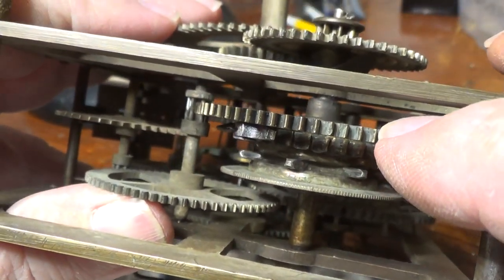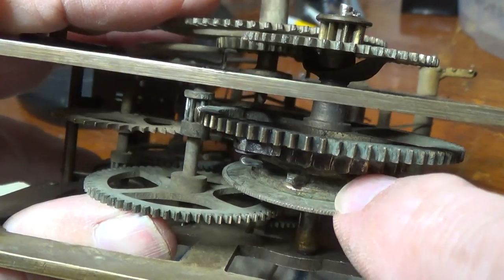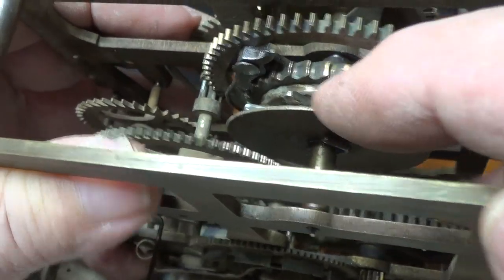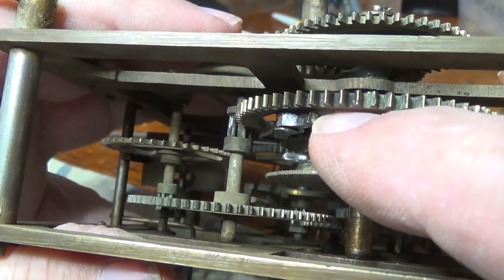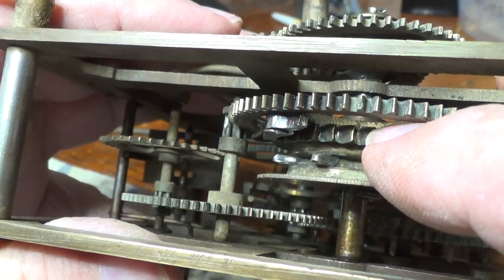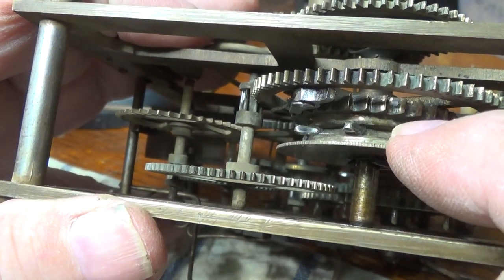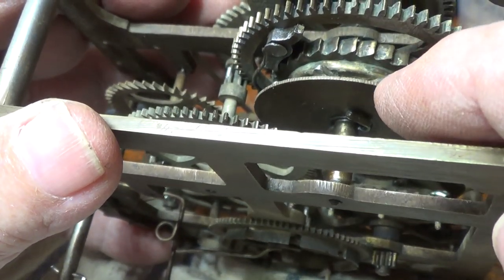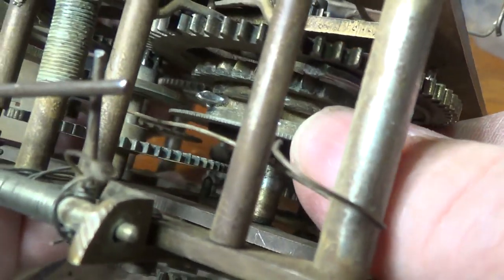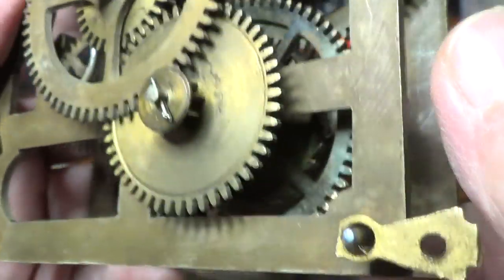In addition, we're gonna have to rebuild these main wheels — that's badly worn. That click, under a given circumstance, can fall down behind the ratchet wheel, causing the weight to drop drastically to the floor and tearing the living daylights out of everything. So that's gonna have to be rebuilt. I may have to order parts — I just hope it's the same size hex brass that I've got. The other one is pretty floppy and loose too. We'll have to determine what the clicks look like once we get all this apart.